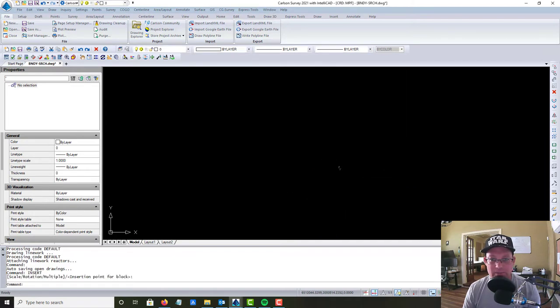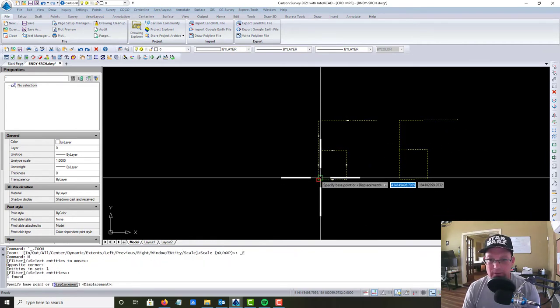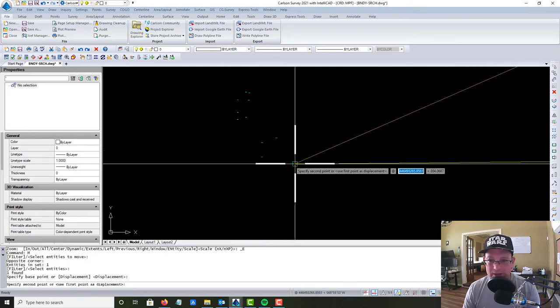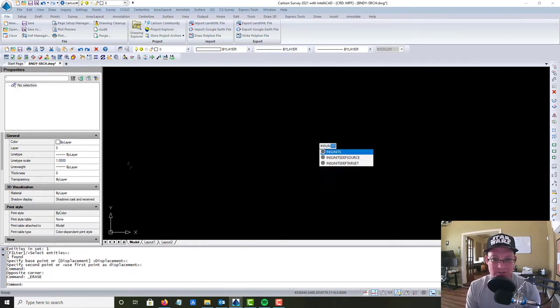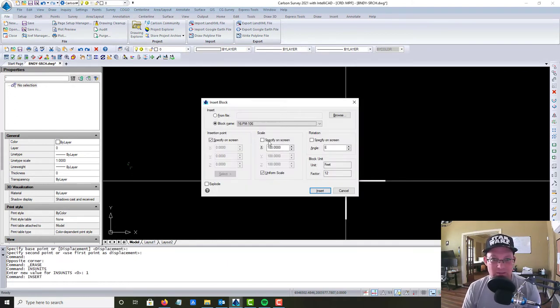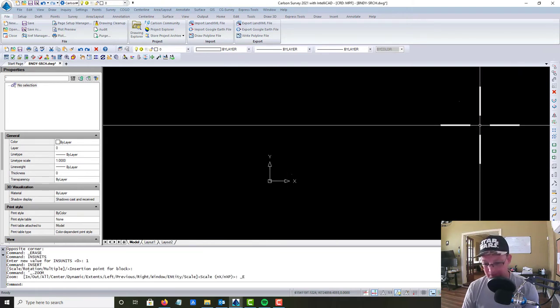And it's asking me to drop it in. Sometimes it ends up way up here, just depending on how the cogo drawing was set up, which is fine. All right, so this map is actually over here, and I can see something's up because this is way too big. So sometimes you got to check your insert units. Let's try that again. I'm not sure what happened there. Sometimes your insert unit makes things come in. Oh, that's because it's getting scaled by 100. So we don't want to do that. So let's try that again. So it was 100 times bigger than it should have been.